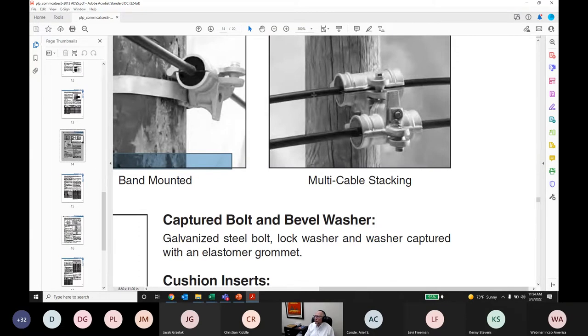Obviously, when you install the cable, you're going to want the cables to have similar properties. So you would have to be careful if you installed, to give the extreme, a big 288 fiber cable here, pushing an inch in diameter, and then here you wanted to install, for whatever reason, a 12 fiber cable that's maybe 0.4 inches. The sag characteristics of the two cables could be so different that under wind loading conditions, they could end up sagging into each other or blowing around each other. Nothing good can happen from that. It may be one of those things that it never causes a problem, but it could.